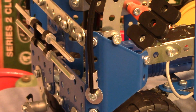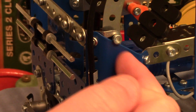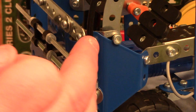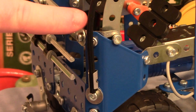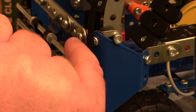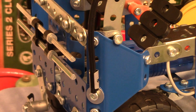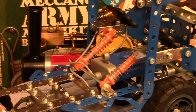Right, we're leaping along now folks, we're up to stage 32 and fitting these bolts through these angle brackets and these odd plates. If anybody knows what they're called, let me know. As you can see, that doesn't allow any clearance at the edge of this plate for the bolt, which means that the bolt is slightly at an angle. Now, the slots are used in the obtuse brackets at the back at full stretch, but there's still not enough leeway to clear this plate. This throws the bolt slightly out of alignment, slightly on a slope, which I'm looking at from the front here, which of course means there are slight alignment issues in the cab, both sides. As you've seen already, those issues aren't that bad, and once it's put together, it'll look fine. So folks, you're probably by now glad to know we're nearing the end.